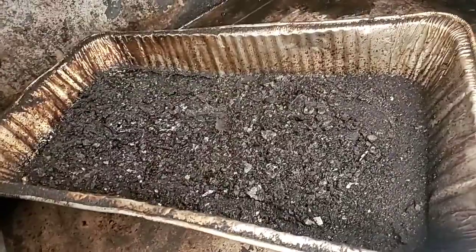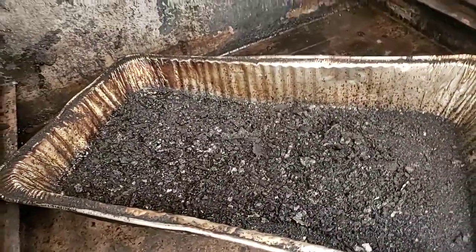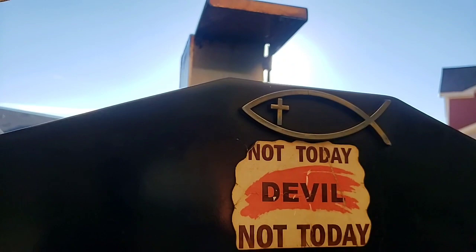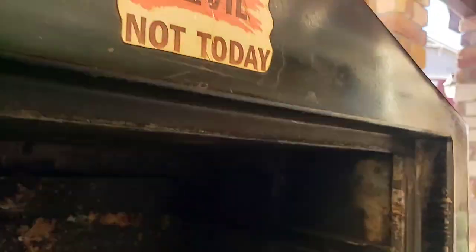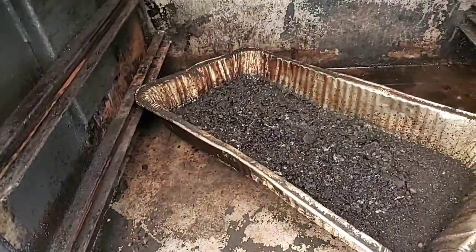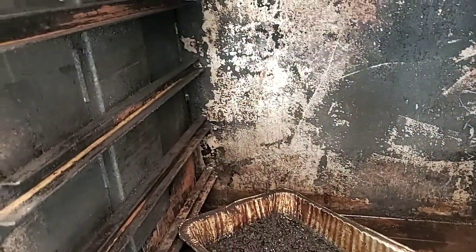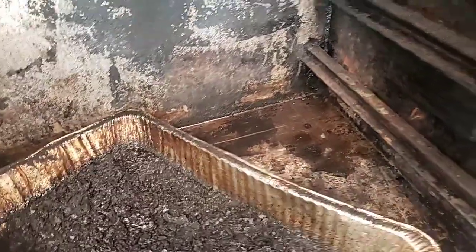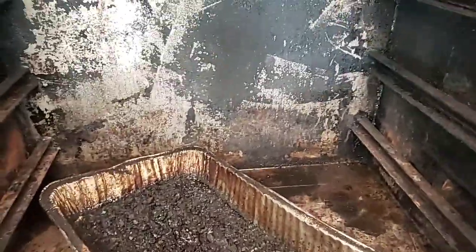I got a lot of the creosote stuff that needed to come off, and this is mostly the second cleaning, so all this came off the sides. I took my shop vac and stuck it down in the flue in the stack and turned it on full blast to push some of that stuff out of the stack and down the sides. Once you do a steam, it just flakes up like this, which makes it easy for that stuff to fall off and clean up a little bit easier.